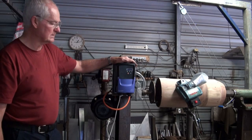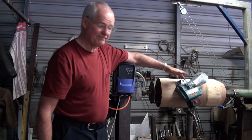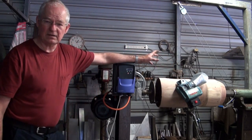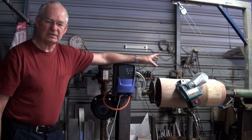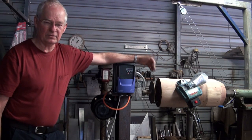Running at about 70 hertz we can use the electric planer head which you can see just here. The planer head allows us to trim the log, get rid of all the knots, all the high spots and make it cylindrical. After that we take the planer head off and we put a standard tool rest so you can do normal hand turning on the log.